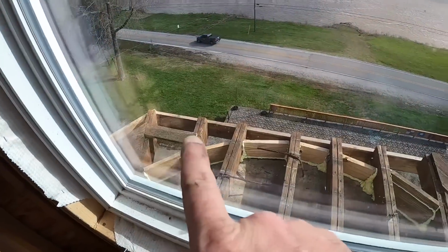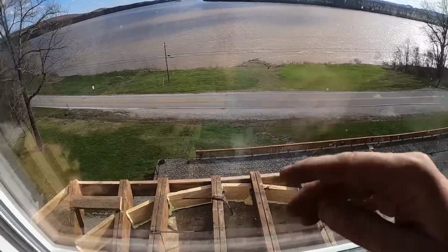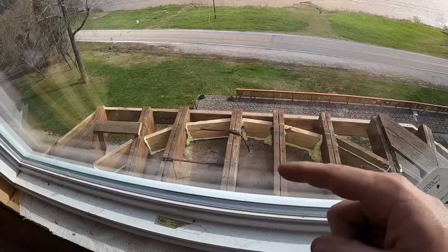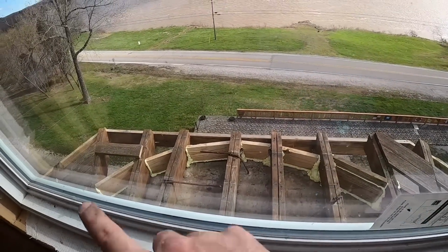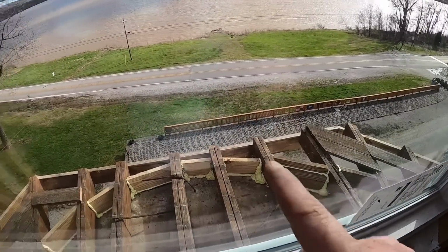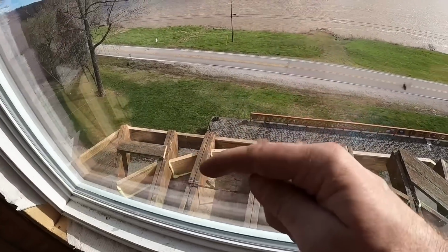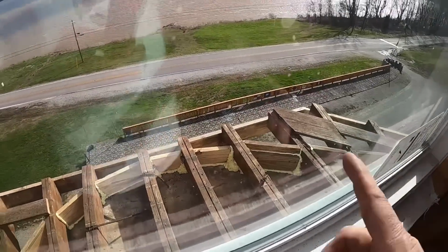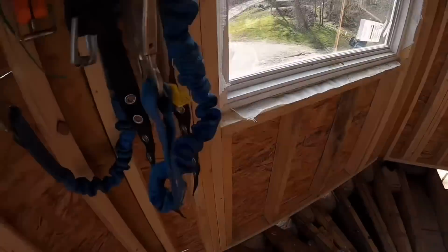You guys can see how we've got the blockers going around. That's kind of what the tower does underneath. Those blocks are sitting right on the edge. And yes, this seals off this top concrete, but when we go to put the soffit around the bottom side of the floor joists and the fascia board, we'll foam the front side of those blocks as well to ensure that no moisture blows up under them. All of them have tar paper under them. But that was the goal for today.